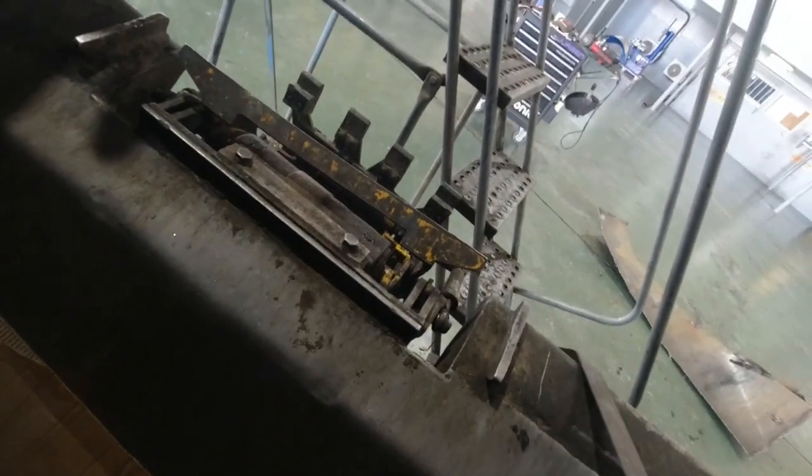You don't need no fancy bender to straighten up the plate. Just hit it on the side. Alright, this is kind of good. But we need this piece to be shorter. It's almost 2.5, so 2 1/4 is perfect. Yeah, man. 2 1/4 it is.